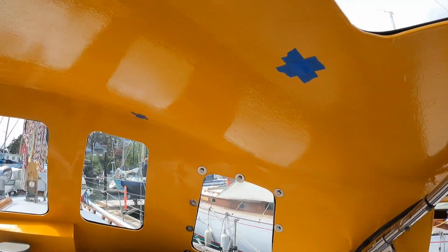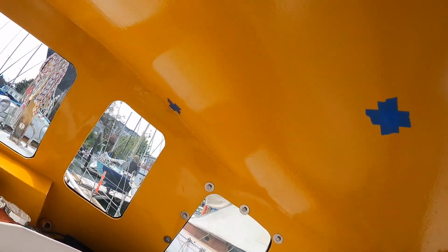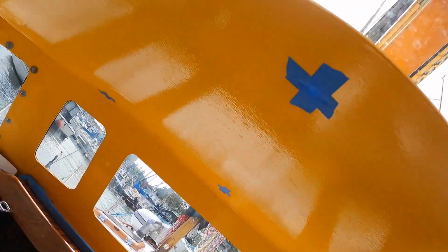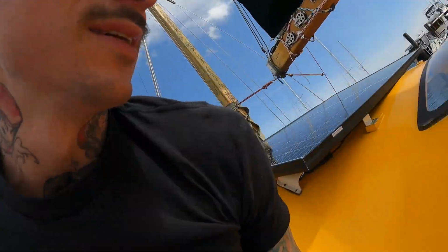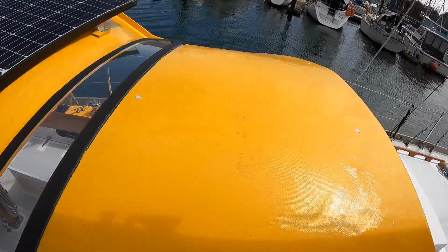So anyways, let's get this show started. Introducing from the yellow corner, solar panel. All right, you've seen this before, but I drilled the holes, so it's already done. Taped the bottom, so 6 holes total. And then I'll show you guys what it looks like on the other side. And then just filled them with thickened epoxy, as you can see. Same as the other side.